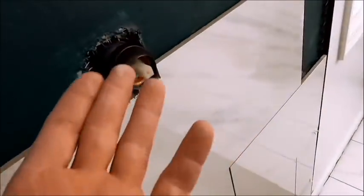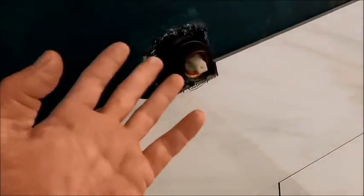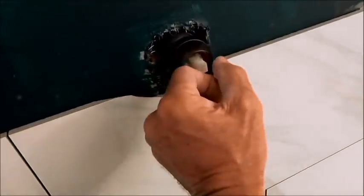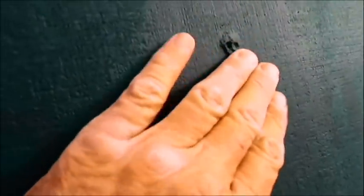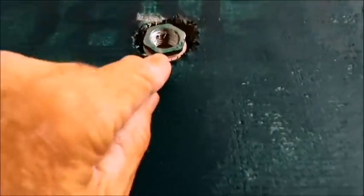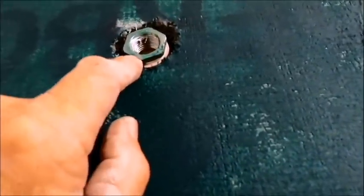They were going to tile around the valve so you could never turn it off, which is crazy. Also, by the time you put your plate on, you're almost to the outer edge - that plate should be somewhere around here. The homeowner said they took the whole box with them - instructions, mud guard, everything - all she was left with is a plate and a handle. They also used CPVC plastic pipe when they plumbed this in. I don't like it but it's there, so I'll deal with it.